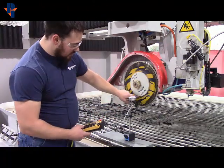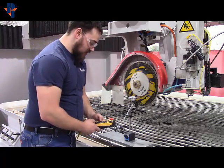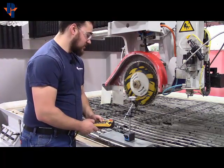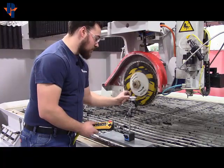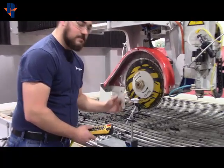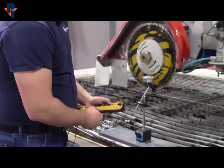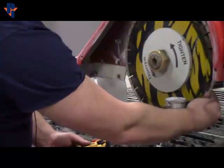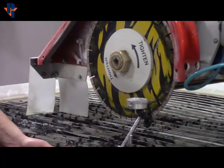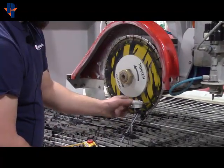You'll want to be about three-eighths of an inch below the flange, and run your Y-axis until you get to zero. On the little dial, it doesn't matter what you're on — just keep in mind what you are on. I always run negative, then I pick a spot on the blade. This one's marked with a white dot. Re-zero it out.